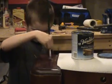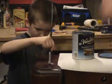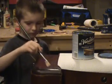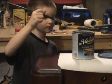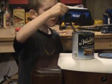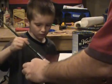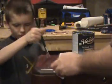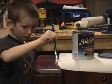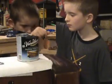And we're going to go with a second coat of the same urethane as before, the Varathane semi-gloss. How's it looking? Good. Okay, give yourself one more dab. If you get any of this urethane on the satin paint, definitely take it off before it dries, or else it'll show up with these bright glossy spots all over your flat paint. Not what you want.